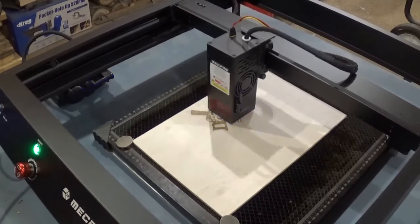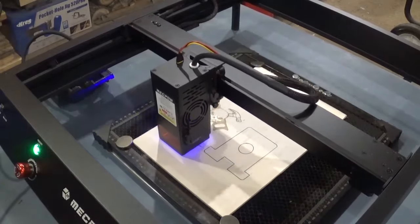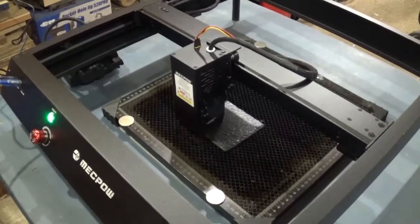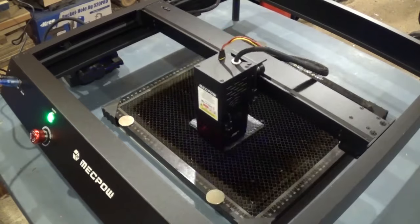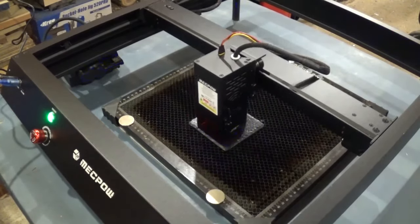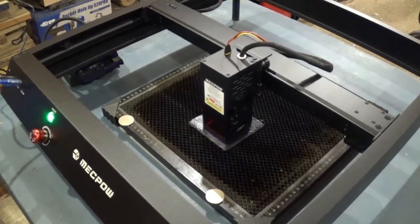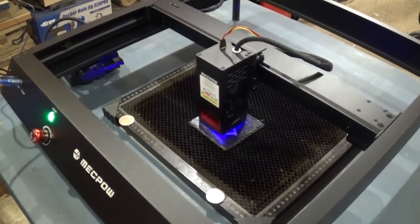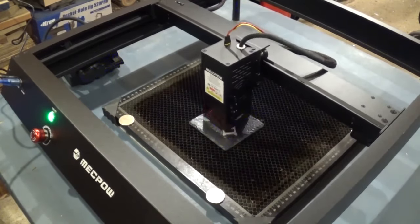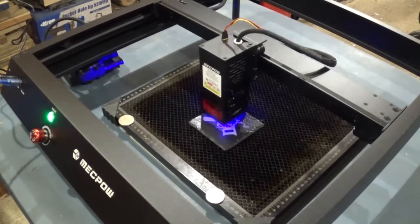You can see my logo taking shape, and now it will laser cut the actual phone stand itself. With each laser you'll have to play around with settings to find what works best depending on its power and wattage. Now we're doing a slate drink coaster — these are always very popular. I'm engraving my Artisan Pirate logo onto it and it takes about eight minutes, depending on how many details are in the graphic. This laser also has Wi-Fi capabilities to run it from your cell phone through an app, though I used LightBurn since that's what I prefer.